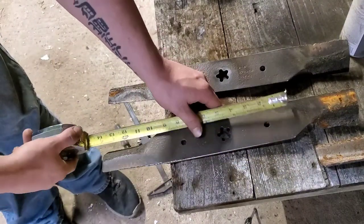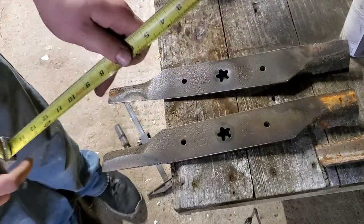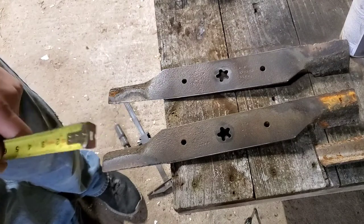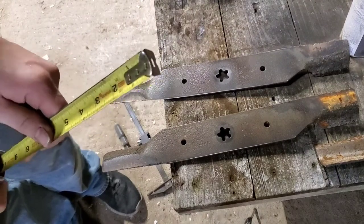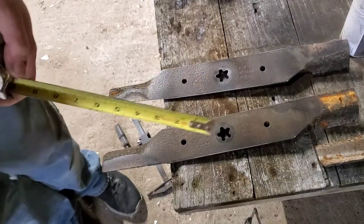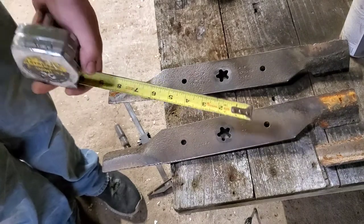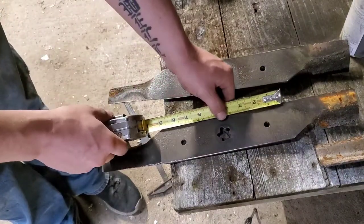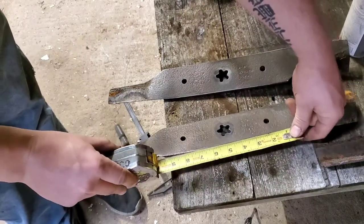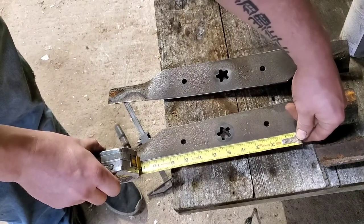So five and three quarters — we're gonna cut these out to eight inches because I want overlap. We're gonna be welding the receiver onto it and I don't want to put a giant seam right there in one spot, because in my opinion that's gonna cause a weak point. We want to spread the load down the neck of the trailer as much as possible. Looking at the material, it looks like we can go about nine and three quarter inches — nine and a half inches — and that'll keep us in full width material.